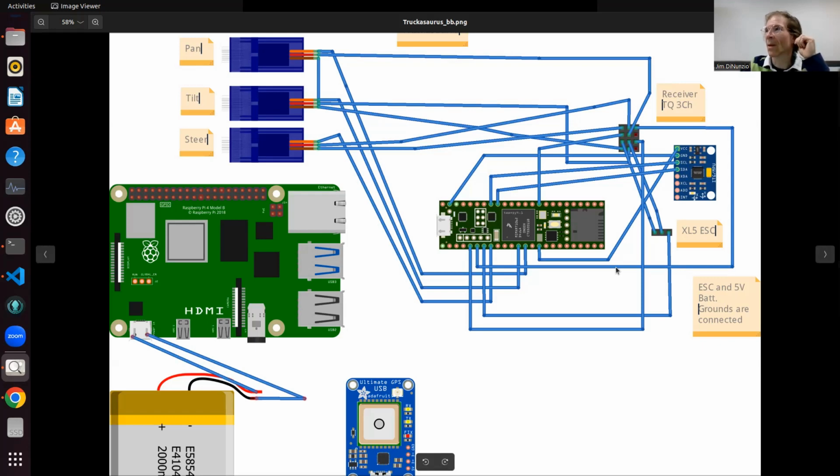Jim, when you're holding down the trigger, that's sending a signal, right? Yeah. How do you keep the electronics from fighting, your micro fighting the signal? Do you have a relay or something that breaks it? Because you have two different things. When does the microcontroller know it can fight against it? There are two modes, auto mode and manual mode, which is set by a variable. I'm going to make it an actual physical switch eventually, but right now it's a variable. When it's in manual mode, the remote acts as a normal remote. It will send the signals to the motors and the steering as normal, as the original product. And when it's in auto mode, this is only used for emergency stop. Does that answer your question? So there's no conflict there. Yeah, it's one or the other.